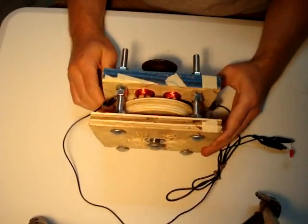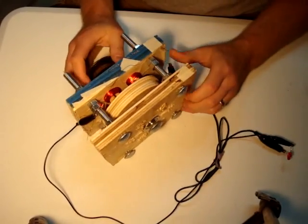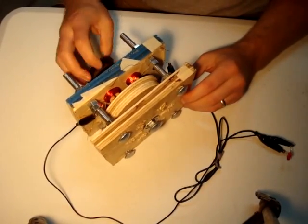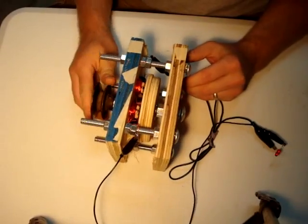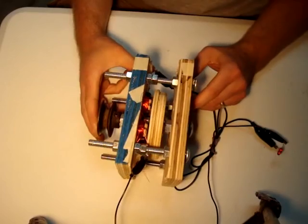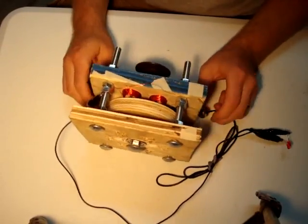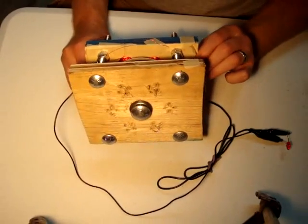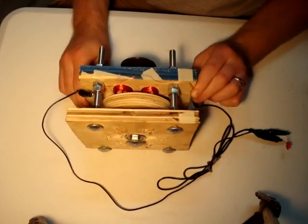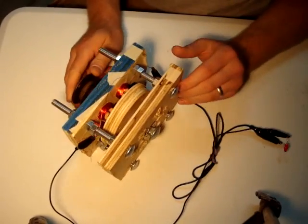This is a little project I've been working on lately. It's just a small permanent magnet alternator. It's just wired up in a single phase, but the way I have it built I should be able to pretty easily take it apart and rewire it for three phase, or change it from three phase to parallel three phase or series three phase.